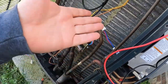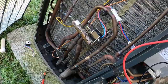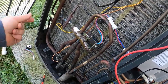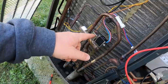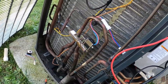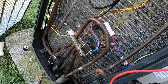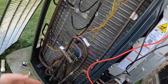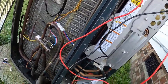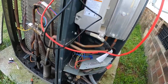I just wish they would do something where it stays energized constantly for either a heating or a cooling call, rather than that little pulse. Because it's doing it every time the thermostat calls — every time it comes on. I don't know what kind of wear and tear that leads to, but it's called technology and I think it sucks, at least when it comes to something that should just be simple. It doesn't have to be so hard to keep a house warm in the winter and cool in the summer.